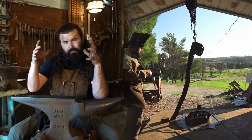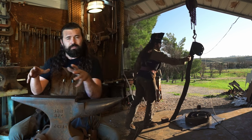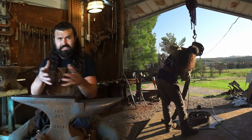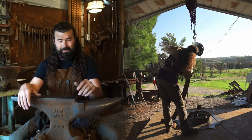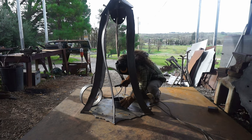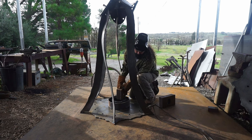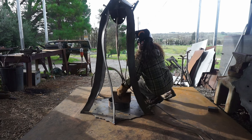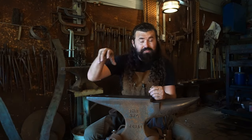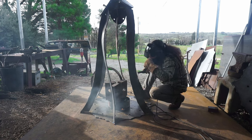The reason I waited to weld the rings into the center before mocking up the trunk shape was for a very good reason — I wanted to make sure I had plenty of clearance. I didn't want to weld those tree rings in and then have my trunk bars not connect with everything in the way. I'm always very careful about how I set things up. I started with a couple of tacks, then I use big chunks of iron — about 60 to 70 pounds each — as a one-sided clamp to pull the plate and rings down nice and flush as I weld.